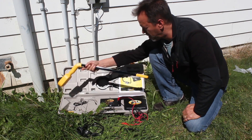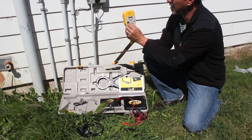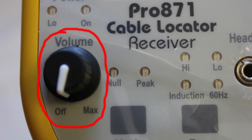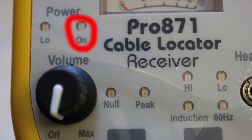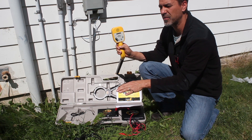The receiver — sometimes called the wand. This is your on/off switch, and it also doubles as a volume control. When I turn that on, there's a power light here. It defaults to null. Null means that when you're traveling over the cable, you get no signal. If I switch it to peak, it's just the opposite — the majority of the signal is over the cable.